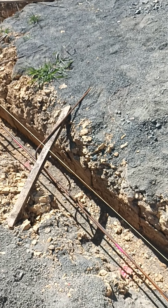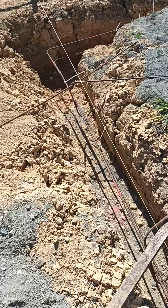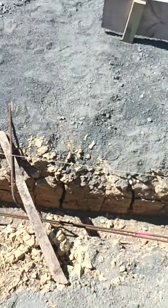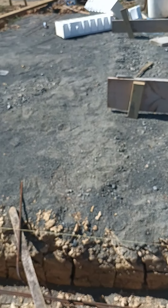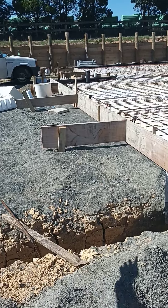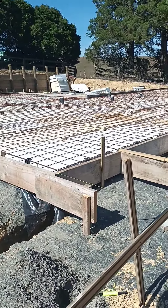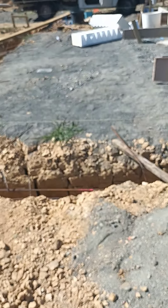It's a six meter length, you might as well cut them into 1500s because if you cut them into 1200s you don't get any — makes sense. We need to take this shuttering down before we can pour this bit, because we can't pour these two bits at the same time. We're going to pour all this on Friday — all the rib raft — and any extra is just going to get dumped into the trench, but we need all these starters tied first.